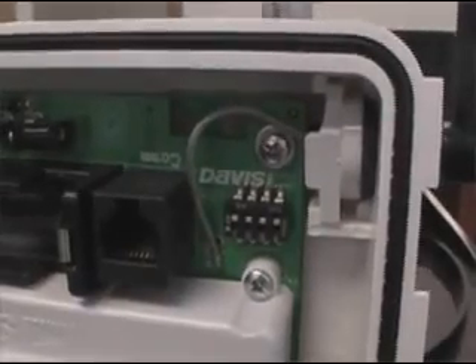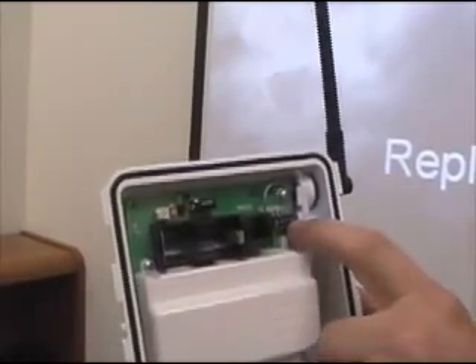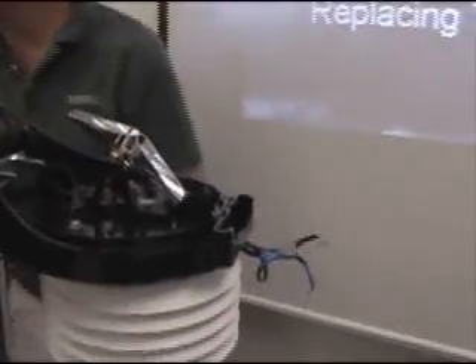There's a large capacitor in here. Even though you don't have the solar panel or the battery plugged in, there's a large capacitor that will still power the system for hours and hours — almost 12 hours on some occasions. So by turning that light on, it'll help discharge that capacitor much quicker. We've also set it to ID number eight, so it shouldn't be active in our system and we won't wind up hearing it on accident if it's still transmitting.